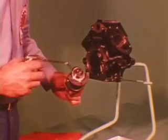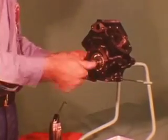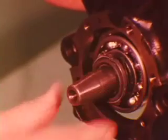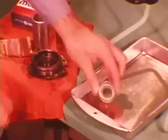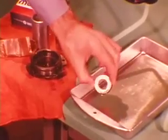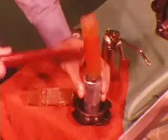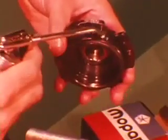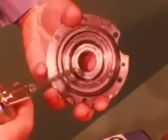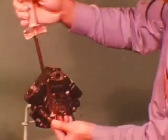Now let's put it all together. The thrust washer goes over the rear journal. Carefully slide the new gas seal assembly up against the front bearing, making sure the tangs are indexed. With the micro-finished surface of the new seal seat plate facing towards you, tap the plate into position. Install a new housing outer seal, wipe with refrigerant oil, and pull the housing in evenly by torquing the cap screws to the specs listed in the service manual.